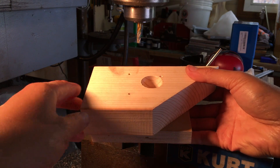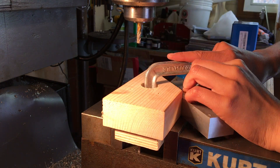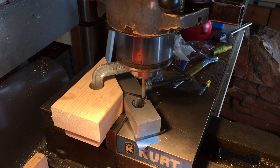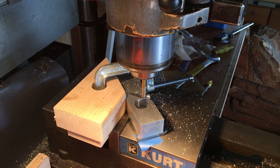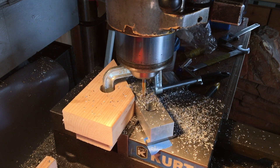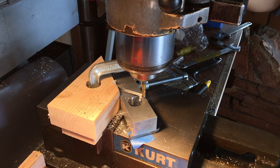For the next step, I made this really simple angled block. The angle here — I'm making the slot for holding the blade — and the actual angle isn't super critical, so that's why I feel pretty comfortable just doing it with this quick and easy block. This slot is pretty deep, so I'm just taking pretty small passes. I probably should have used a smaller clamp or angled it more to give the bit more clearance so it wouldn't have to stick out too much. But it's a quarter inch carbide bit and I didn't have too much chatter, so not that big an issue.